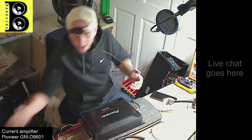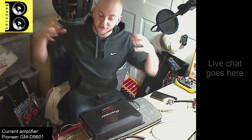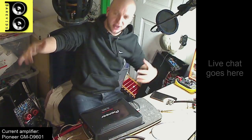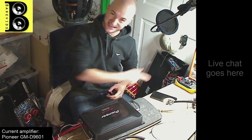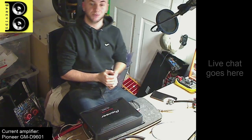This gets even more intense the bigger the amplifier. This is only a little 1,200-watt amplifier. If you were to go for a 5k, 7k, 8k, or 10k amplifier, the voltage drop across the rails gets infinitely bigger, and the difference between unloaded sine wave amplitude and loaded sine wave amplitude becomes even more drastic. With a large amplifier and no subwoofers connected you'd see a huge clean sine wave on the scope, but connect your subs and play the exact same tone and it will be heavily clipped due to voltage drop across the output rails, the power supply, your cable, and your batteries and alternator.